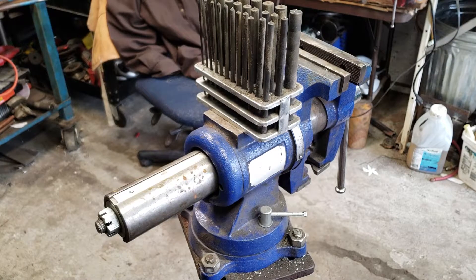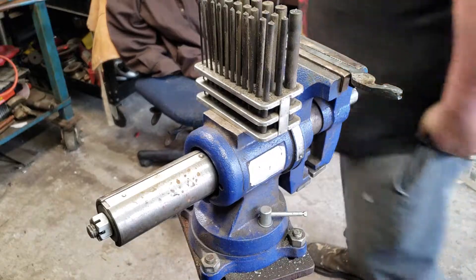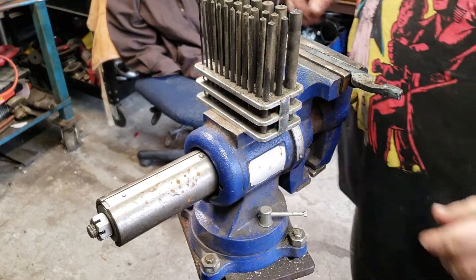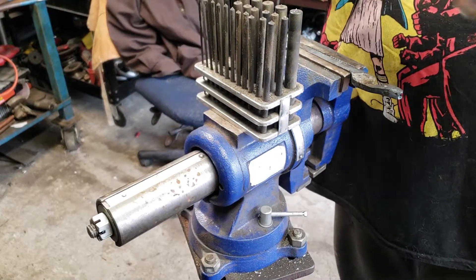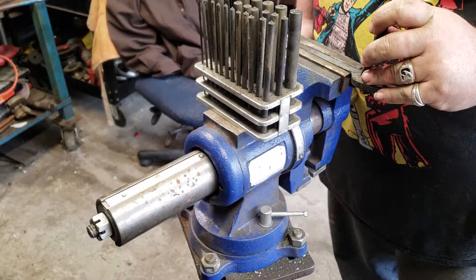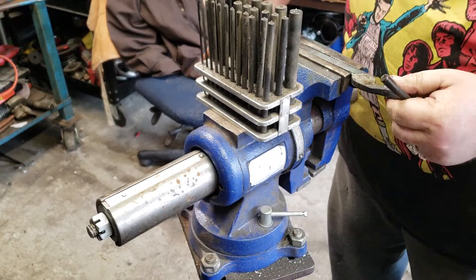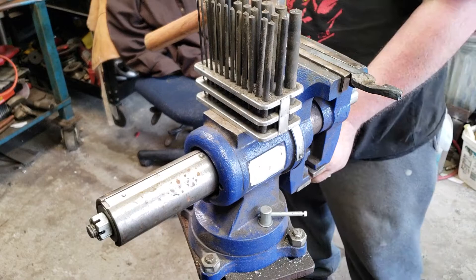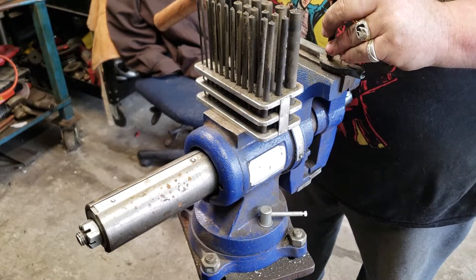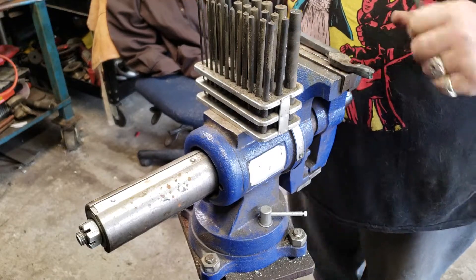What I want to do here — I was doing some tongs and I was drilling and putting rivets in tongs. The way I like to do this is I'll take one of these center punches, usually just any one I feel like at first, and find where I think it's center and just use it as a normal punch for right now. Just give her a whack there and we got ourselves a nice little dot. Then I'll move it over here to give myself a nice clear, hard hit so you can see that hole there.